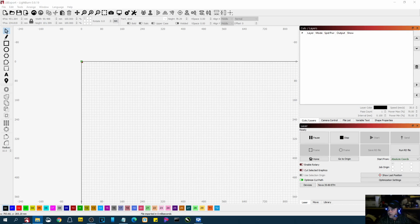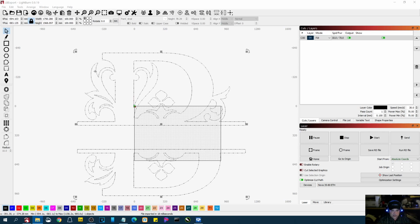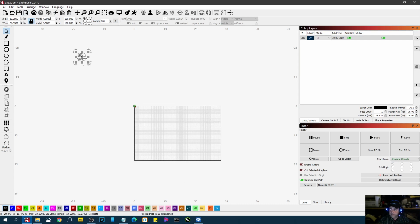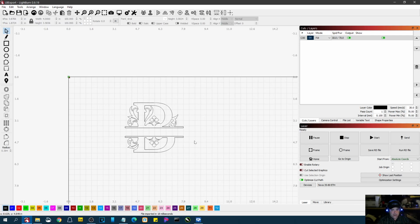And I've got a monogram here, and I'm just going to drag this. It's a DXF file, and I'm just going to drag this in here, and that's way too big to be manageable. That's not practical. So let's make the width, I'm in millimeters now, but let's think in inches. All we have to do is switch. And let's just say they're about 4 inches. That would make a good size Christmas ornament. And we'll drag it down here on top of the table. So let's get in here where we can look at it. That's how easy it is that you can import something.